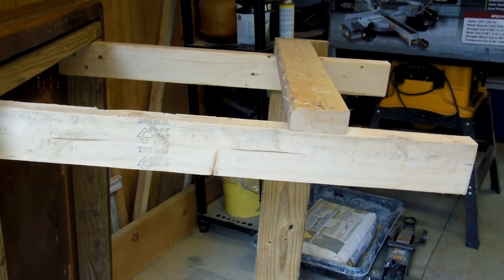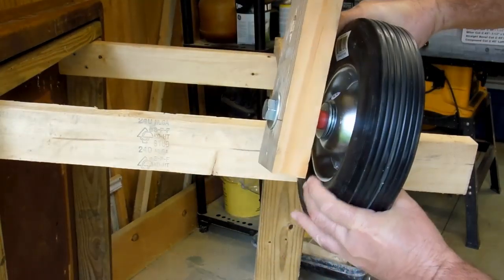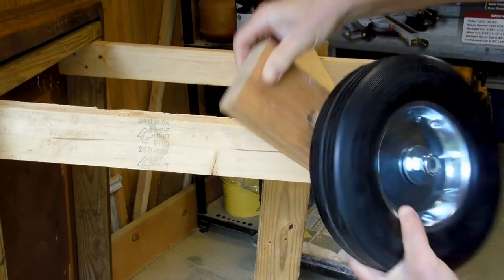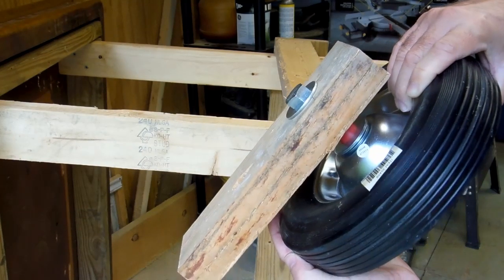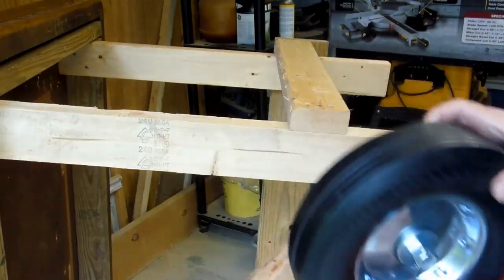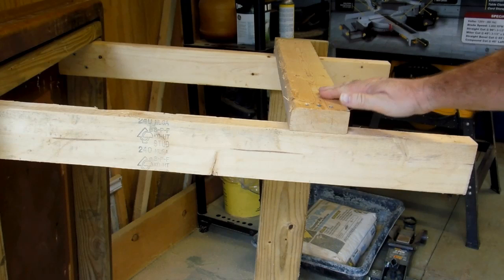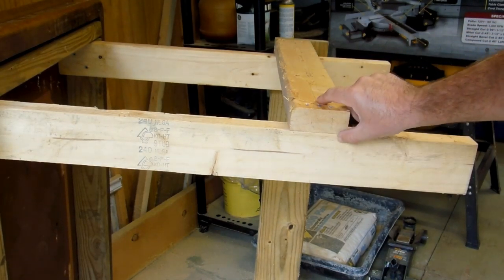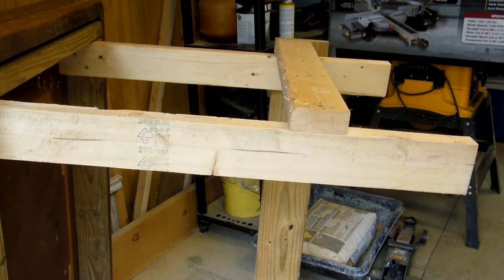Here's our work table flipped up on its side. We're going to go ahead and put these 10-inch wheels on this end, on both sides, so we can basically make this table easy to move around. As I showed you in the mock-up down in the shop, this will be the leg — we're going to take and cut it down by a certain amount, drill a hole for our axle using this 5/8 by 5-inch bolt, and we should have ourselves a nice portable table. We're also going to take this cross piece — which used to just be a surface butt joint — notch it down and set it in so it's a little more stable, since we're using big saws on top. Kill two birds with one stone.